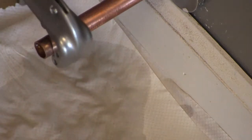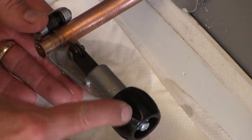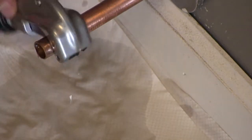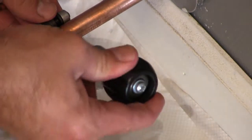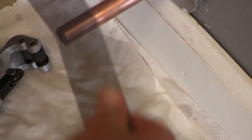I'm going to get right behind where the ferrule was and softly get the cutting wheel placed up against the copper pipe. As I turn, each revolution I'm going to tighten the wheel a little bit more. You can see how the cutting wheel is making contact with the copper line — just gently, because I'm going to score the pipe every time. I'm slowly cutting the copper pipe without damaging the diameter and circumference. It has to be a perfect circle when I'm done. Then I'll take an emery cloth and clean that pipe off so there's no soot between the pipe and the ferrule.